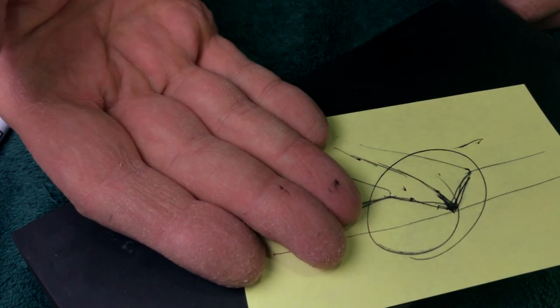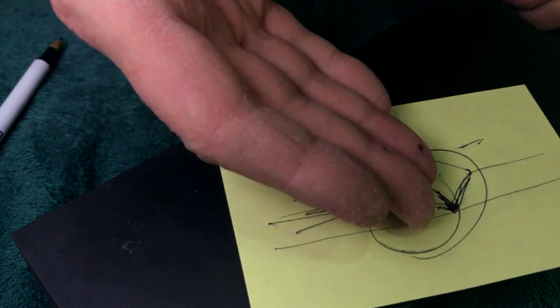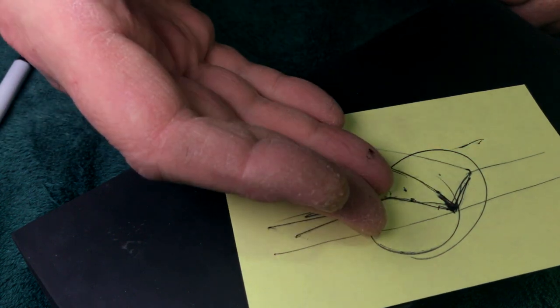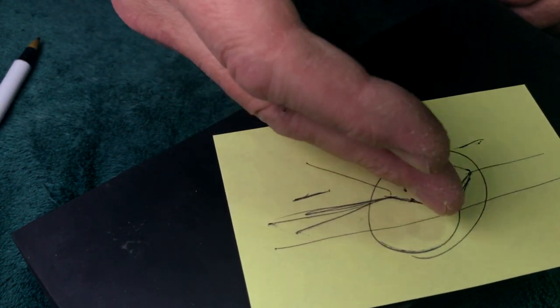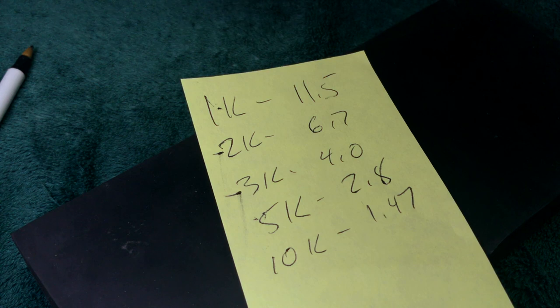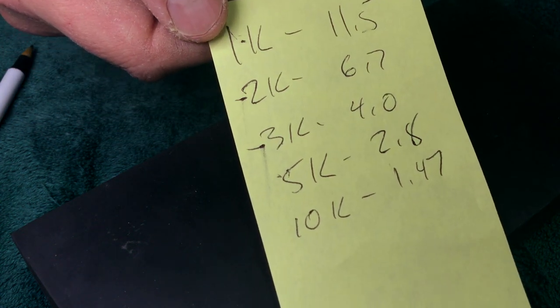So a lot of people who talk about chipping, that's where this comes from. When people tell me, oh, can I overhone? Yeah, you can. But most people underhone. That's what happens. All right, so let me clean up some of this nonsense here. Did you get that? Take another look. Anyway, it's in the Unified Grit Chart. That's where I got the numbers from. So it's helpful, but it's online. You don't need to copy it from here. So anyway, that's what happened here. I went from 1K to 6K, and I wound up with some teeth down at the edge.